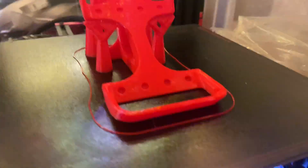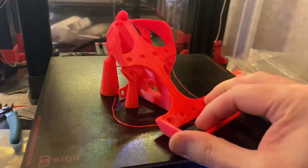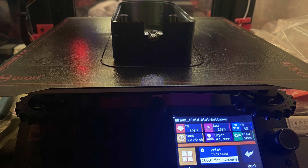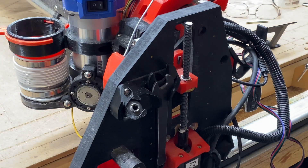I've designed this 3D printed holder, and it's intended to have small round magnets in it. I'm going to print another base that has sockets for small magnets on the back of it. I'm going to use a 5/64th drill bit to pre-drill for these.